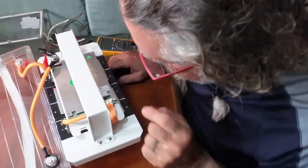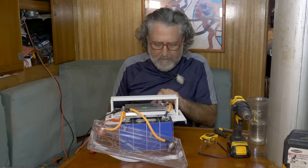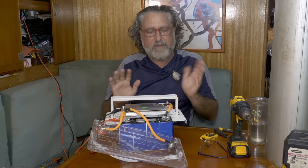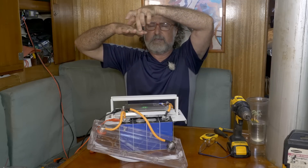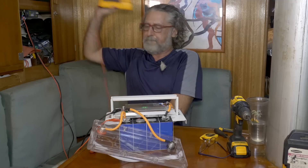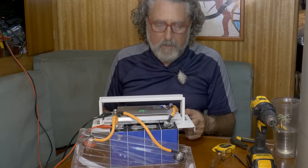After charging for a bit, I see a light blinking labeled BAT 1 — now another one's blinking at the end. What we're seeing is these individual cells coming up in voltage. Now a third one is blinking. This is the passive balancing trick: whenever one of the cells gets above a certain voltage, it puts a little resistor across it to take power out, trying to get them all even. It's still taking a charge though. The voltage reads 14.19 volts and going up — it'll go up pretty fast now that we're up in what they call the hockey stick.